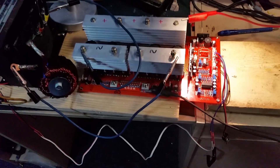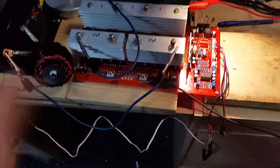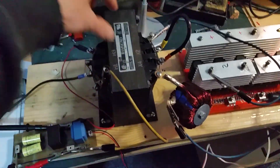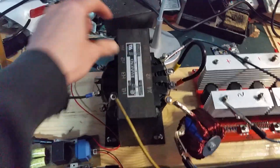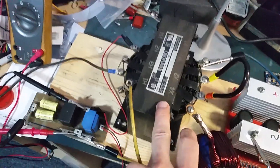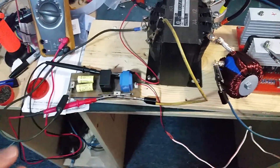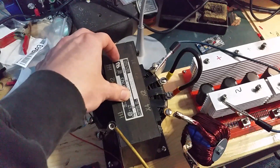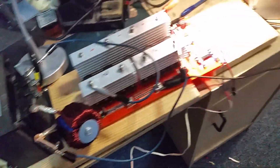It really depends on the transformer you use, because all this board does is take your battery voltage and turn it directly into AC at 50 or 60 Hz. There's no boost, no buck, nothing. It relies on feedback and a transformer such as this one — this transformer is only good for 500 volt-amps. A lot of people say watts, but volt-amps and watts are not the same thing. If you're only using resistive loads with a power factor of one, then they are the same. But volt-amps are really what your transformer is limited to. They'll rate these inverters in watts, but they really mean volt-amps.